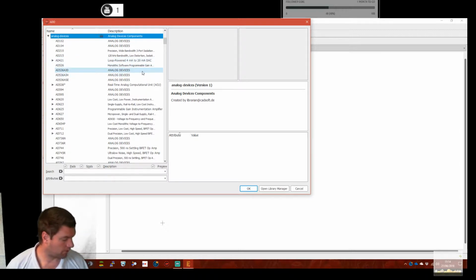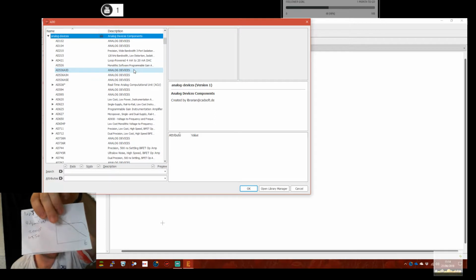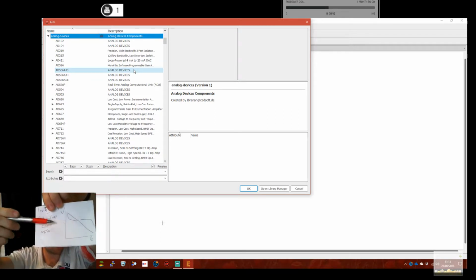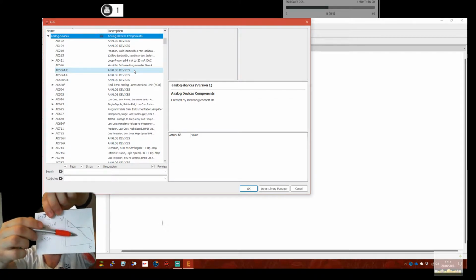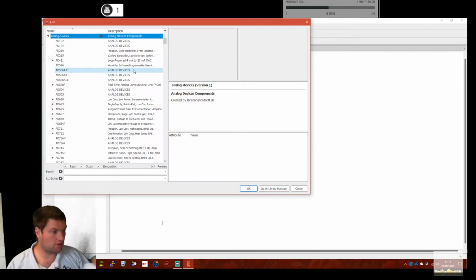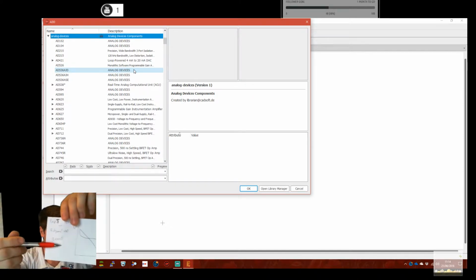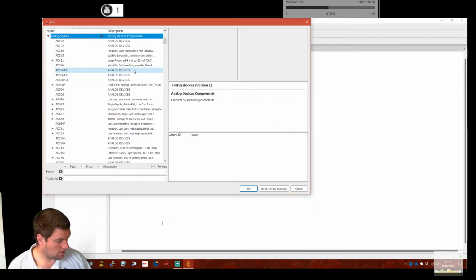So that's no good. If we want to power a string of LED fairy lights, for example, you need a constant voltage, because you don't want the brightness tailing off, because as soon as you get to this point, the LEDs aren't going to light, for example, on an arbitrary scale on here. So you need to boost the voltage when it gets low, but you may need to buck the voltage, i.e. reduce the voltage, when it's quite high. So the output needs to be a reasonably stable voltage.